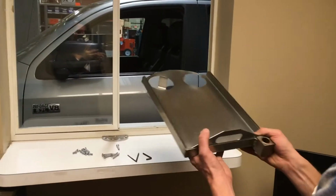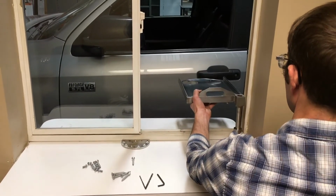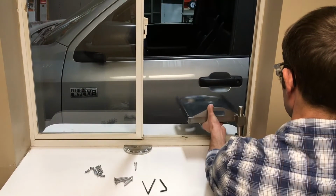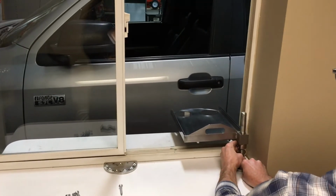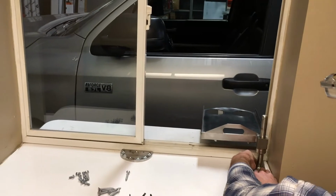Once mounting rod is in place, slide the mounting collar on the center of the mounting rod and tighten the screw with the provided Allen key. Do not over tighten mounting collar, as this will be adjusted at a later point. Firmly hold down the mount rod and place tray assembly on the mounting rod, resting on top of the mounting collar.